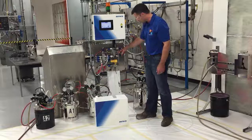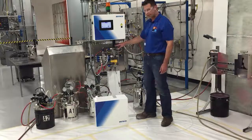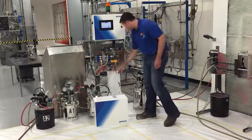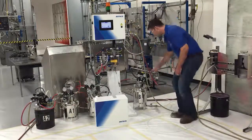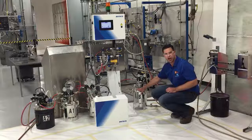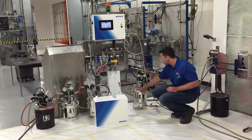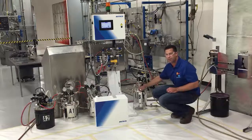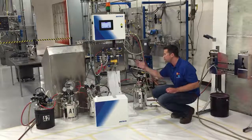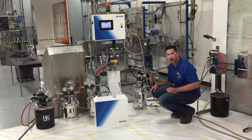To summarize: we have PTFE hoses in line, we have proper iso-oil that also comes with the systems, we have PTFE hoses feeding through the unit, we have bottom outlet kits, and we have a nitrogen blanket or a three-stage filter with desiccant air to ensure that we don't get any moisture. This is probably the most vital area where we want to make sure we have the right components and equipment set up, so we don't have any chance for the catalyst to absorb moisture, which can end up creating hardened parts of your line and prevent the equipment from functioning properly.